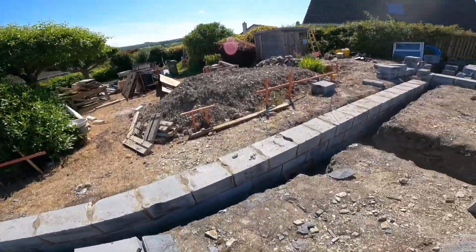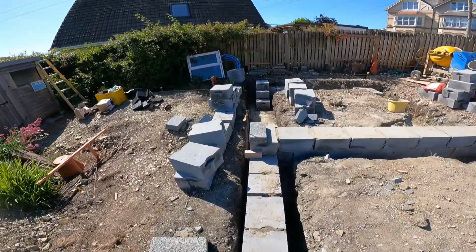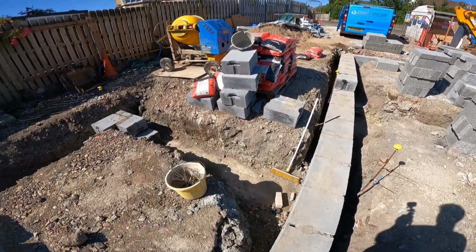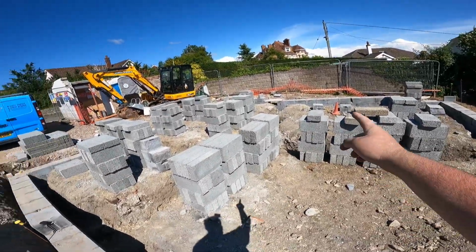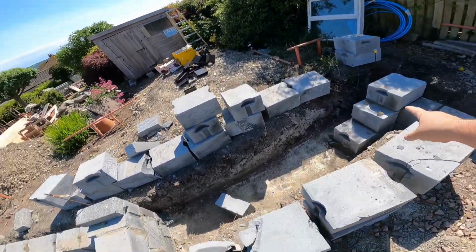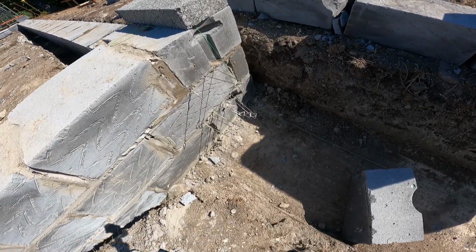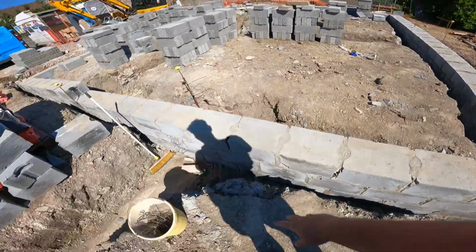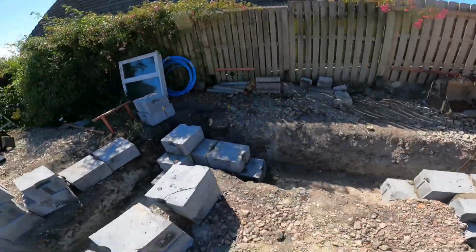And yeah, I think that's, well, nearly all of the trench blocks laid. We've got this small section to finish tomorrow, which me and Matt are gonna jump on while the others load out the rest of them blocks and have a bit of a clean up from all the cuts. So this is just three high running in because the wall, you can see there, is inset 100 mil. So yeah, obviously we've got plenty of wall ties there. So yeah, we'll just run this through tomorrow morning.